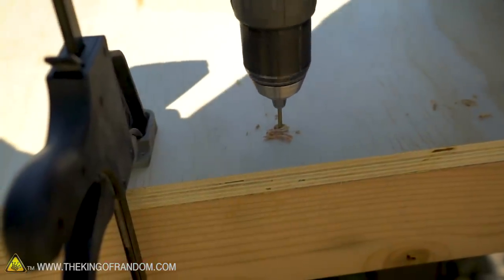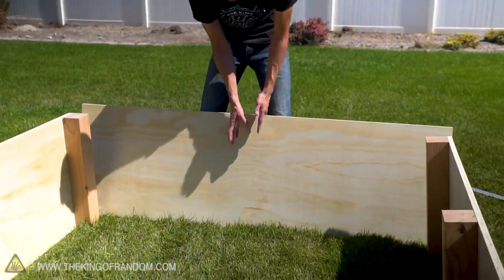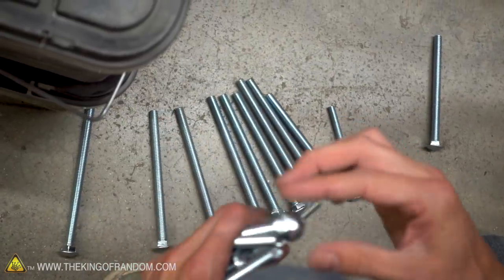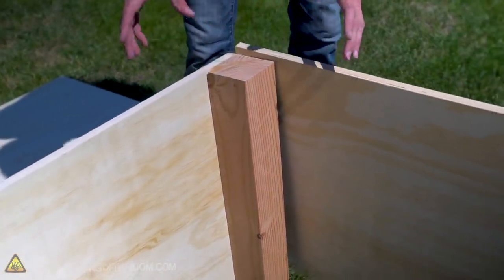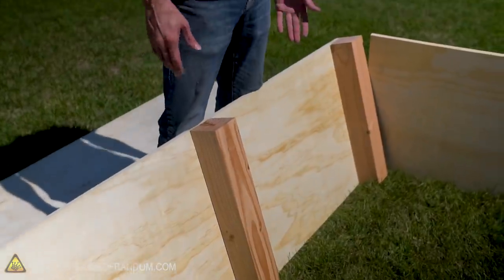You've seen that I used a lot of screws to attach the four-by-fours to these boards. What I'm going to do to attach the middle beam is drill holes all the way through and use carriage bolts. That will give a really strong connection to the post with no play and no wobble, but it also makes it easy to take apart when I need to move. This piece can fit through pretty much any door frame, and the whole bed should easily dismantle down into pieces I can carry.